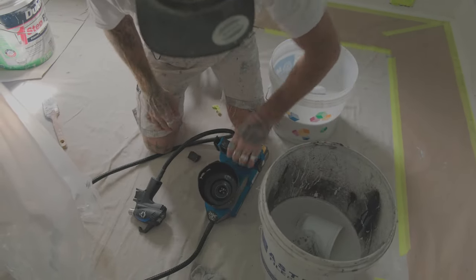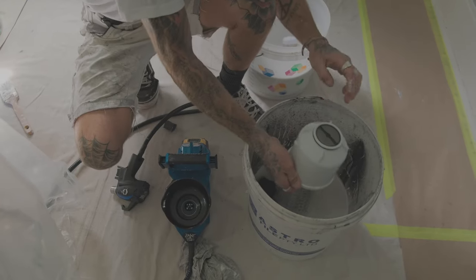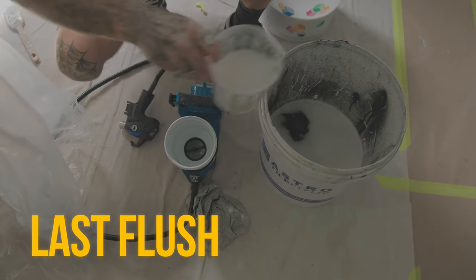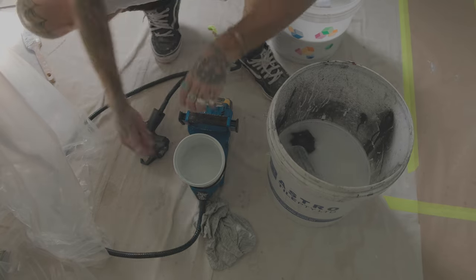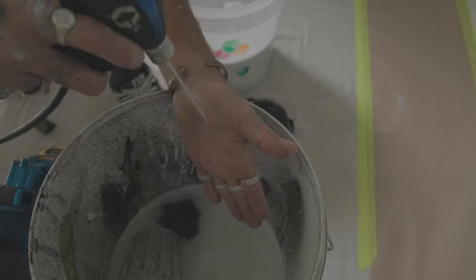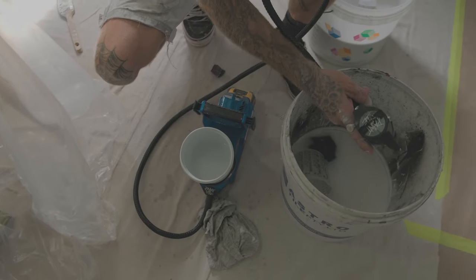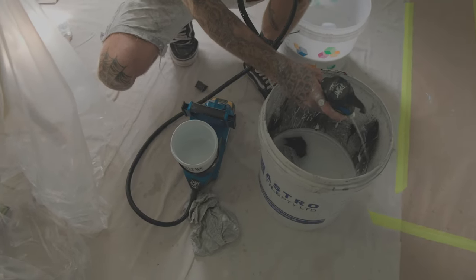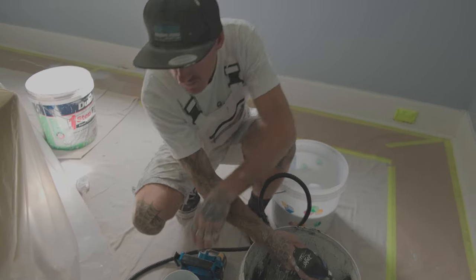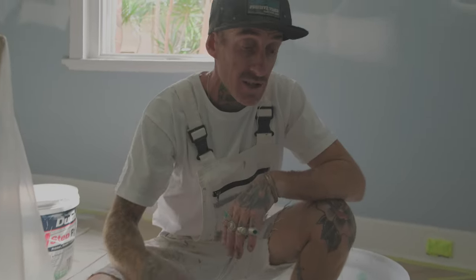So now what we've done - it's pretty much clean inside here. After I've wiped it all out, make sure your cup is completely clean. I'll sit that back in here and do one more flush - go to spray, and you'll see it is really clean. Flick it back up to prime to get any leftover materials that are in the rest of the gun or your machine. Just suck it dry. Now the inside of your machine is clean and the outside is clean - it's pumping out nice clean water.